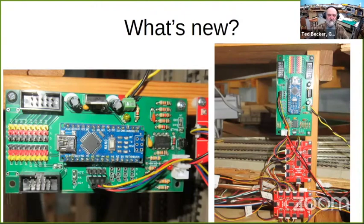The other 4 I/O pins, I have pads here where I can solder pins, and I just didn't populate them. And if you're counting, you'll find that I'm 2 pins short. The reason for that is I use software serial for the bus. I do not use the built-in serial port for a couple of different reasons, which are beyond the scope of this. Anyhow, here's the installation.